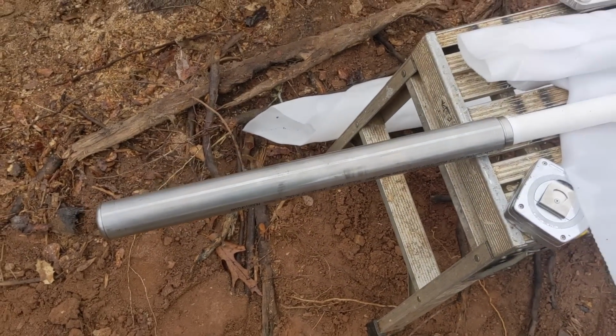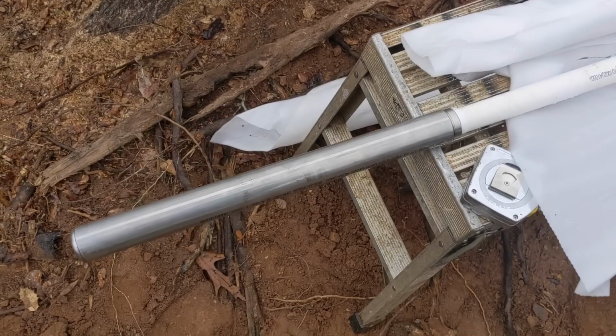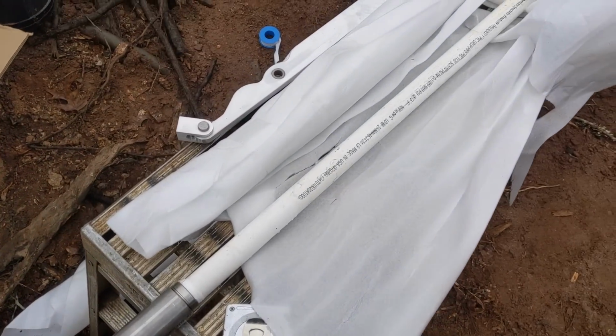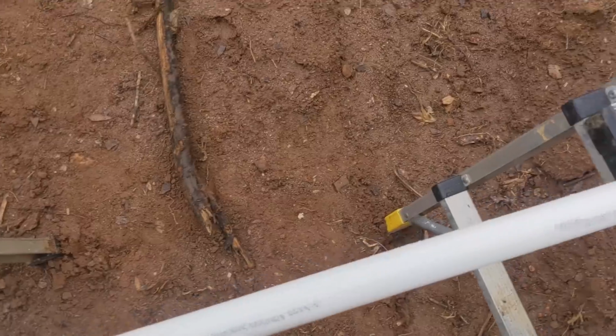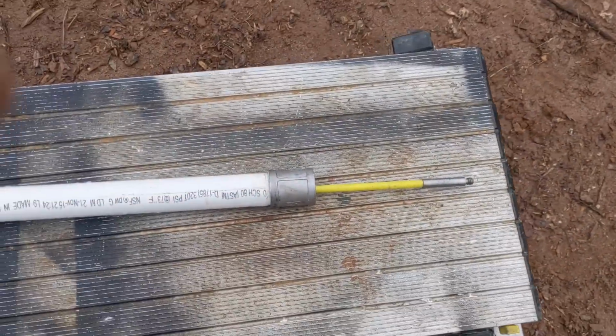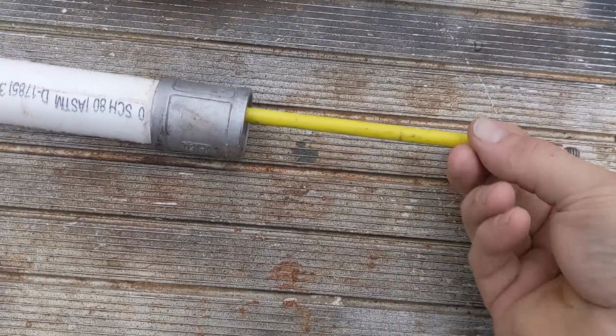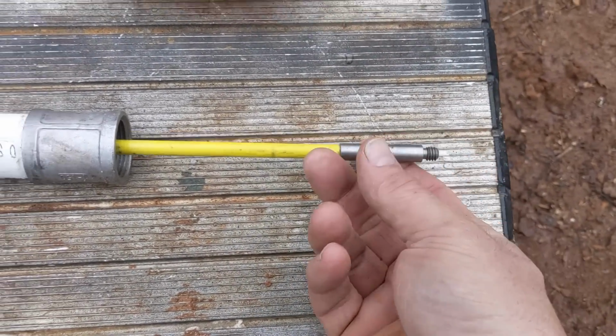So when the piston goes down, when you lift your handle, it grabs about a foot of water, and then when you push the handle down, it lifts that water up. So technically it's a lift pump, it's not a suction pump. Each one of these sections is 9 foot long, these drop pipes, and the very top drop pipe gets a weep hole, and we'll show you that. The fiberglass rods, these are what connect the piston to the handle at top, and we'll show you those components.